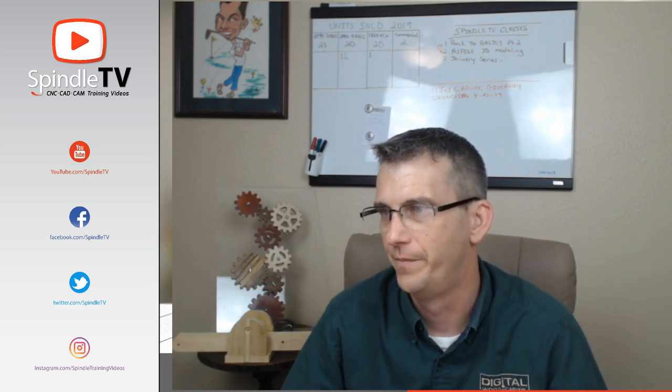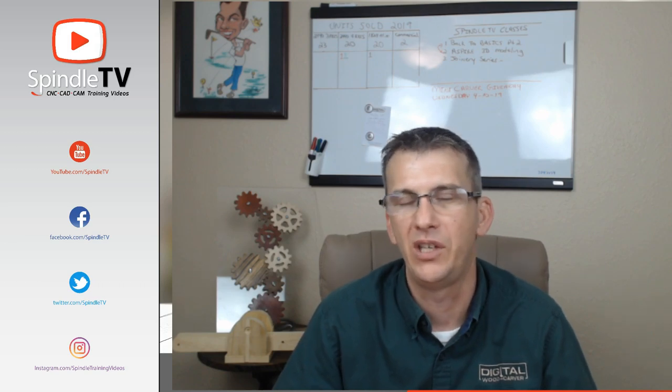And when it's raising up and coming back, it's coming back at its rapid 200 and something inches per minute. You know, when it's rapidly moving back, it's at its rapid speed back to the beginning and all. So yes, you're sacrificing a little time, but that time is improving your quality. So for me, absolutely, I don't care what size machine it is. I always recommend surfacing in one direction.